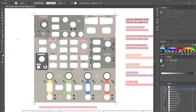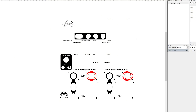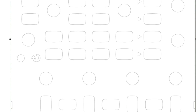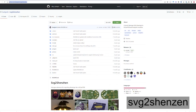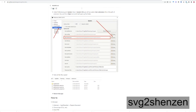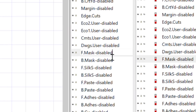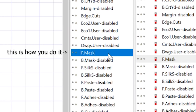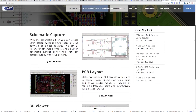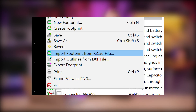We want a layered image in Inkscape where each color is one layer, and you know what PCB layer those colors correspond to. For example, on this board I started from an Adobe Illustrator file, rasterized the colors, and imported it into Inkscape. Once we have our color layers, we also need to define the shape of our board so the fab knows where to cut the edges and where to make holes. These cut lines should be just a line in Inkscape, not a solid polygon or shape. Download and install the SVG to Shenzhen Inkscape plugin — this lets you save vector layers in Inkscape as PCB layers. Take each of your layers and one by one assign them to a PCB layer using the SVG to Shenzhen plugin. I've done all this with KiCad, which is an open source PCB design tool. Take each of your files from SVG to Shenzhen and import them as a footprint into KiCad.